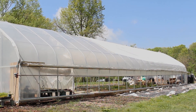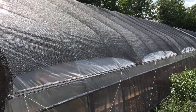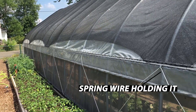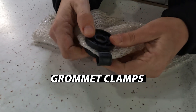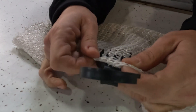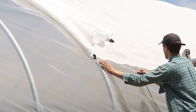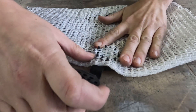Once the shade cloth is positioned on top of the structure where we like it, we're going to use grommet clamps on the shade cloth. These are a great piece of hardware to make grommets affordable. You can get shade cloth with finished edges and brass grommets, or buy shade cloth wide enough to overlap your hip rail and use spring wire to hold it in place. But these little things can save you a few bucks and they work pretty well. You can open these grommet clamps up — they have teeth that bite into the shade cloth holding them in place. Close the grommet clamp over the shade cloth near its edge wherever you want to make a grommet, and you can also fold the shade cloth before sandwiching it in the grommet clamp, though that's not required.